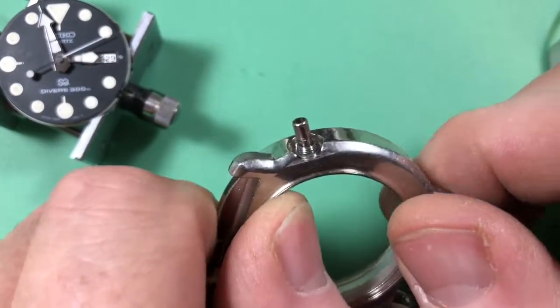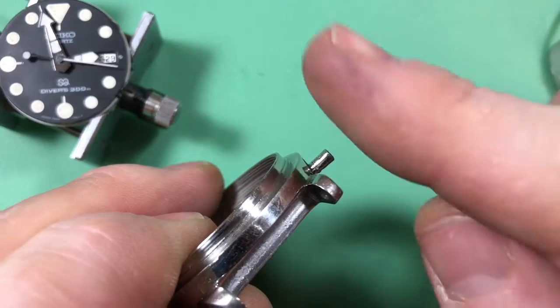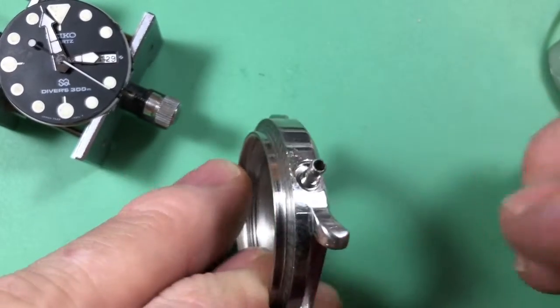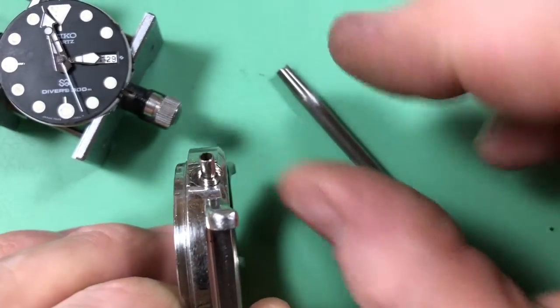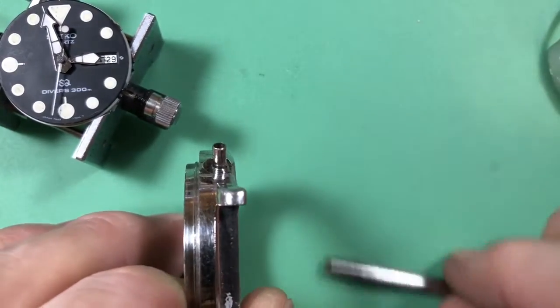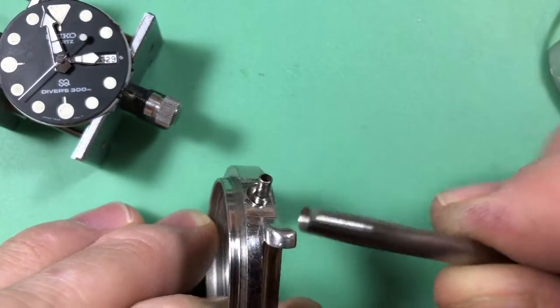You may remember I talked about your crown tube. I've improved it. It's still got some divots in there, but it's straighter. It also was bent upwards, so now it's straighter and I've cleaned it up, and also somebody had been wrenching on it, and this right here, it's not supposed to be just a straight tube. It's supposed to actually neck in a little bit. It's supposed to get tighter right at the edge. And so I had to restore that because it was kind of flared out like a trumpet, and it was also smashed into sort of an oval.